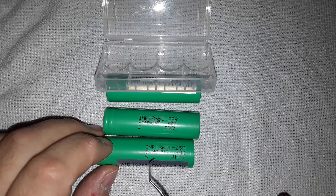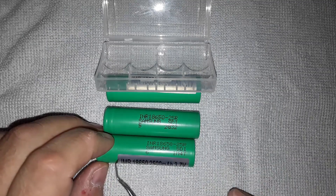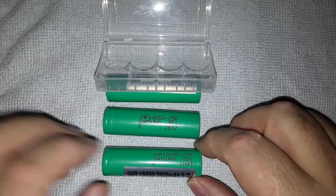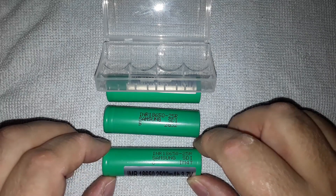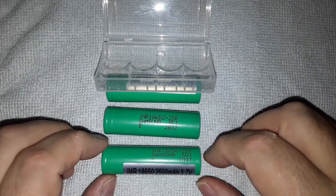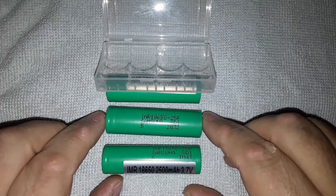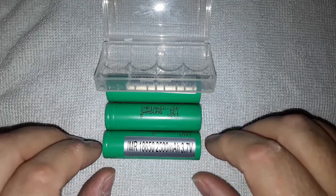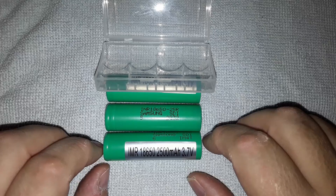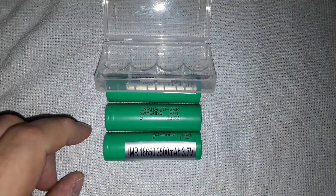Customs can't say you're trying to pass a counterfeit product off as genuine, because I think these are made as counterfeit in China and then the mark is covered up to get them through customs. Of the original batch of four, one was rejected by my battery charger as a dud - it wouldn't charge at all. One was actually pretty close to the manufacturer's spec of 2500 milliamp hours. The other two were significantly below - 25 to 30 percent below - and they probably wouldn't last for as many charge cycles. They might have been recycled from used laptop batteries.